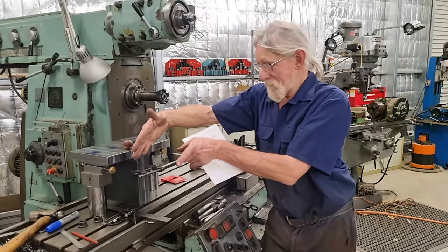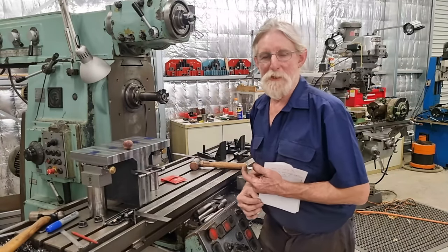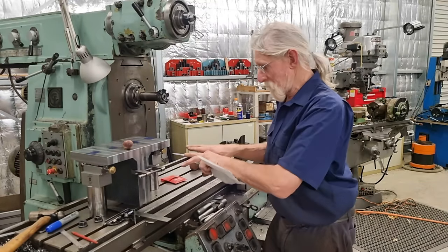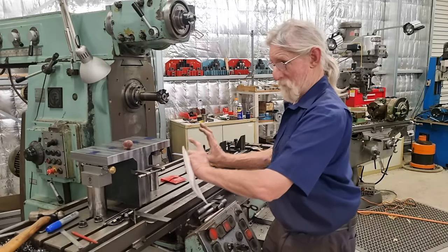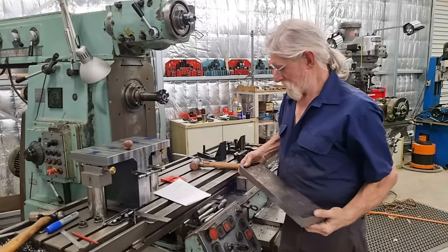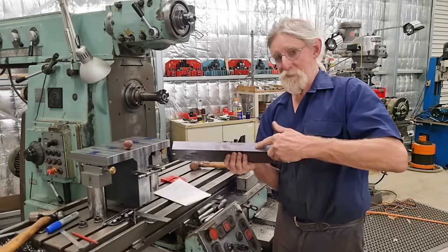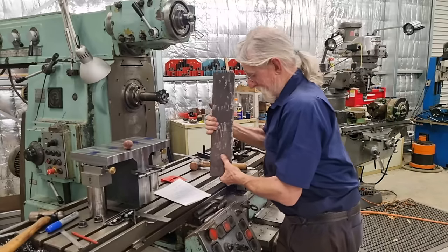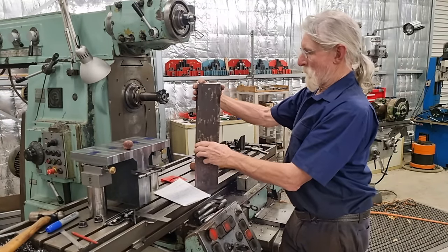Now, after machining either side, when I unclamped it, it bent about half a millimeter, 20 thou in the middle, and that was a meter long when I turned it up on edge. It didn't bend the thin way, it bent edge on the thick. I'll go and get it. This is a bit over one third of it. So that edge was machined. That edge was machined. It didn't move that way. Move that way.